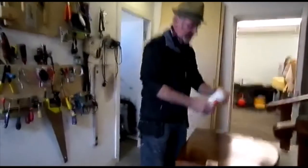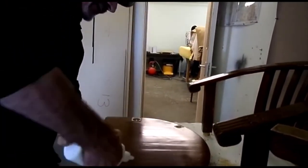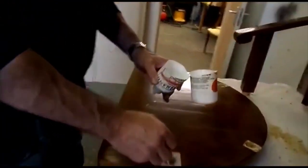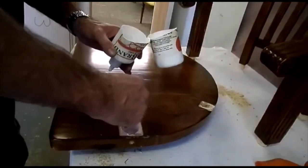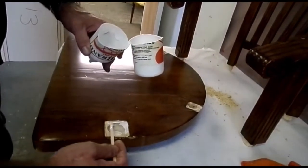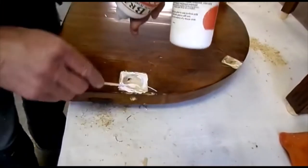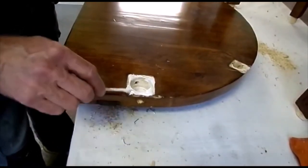There are a lot of better captain's chairs than this. I'm just going to use polyvinyl acetate — a wood glue. If you've got clean surfaces and the joints fit pretty well, there's nothing much better. For porous surfaces like this one, a good coat on one surface will do. For non-porous surfaces, put a coat on each and let them get dry or nearly dry before you put them together.